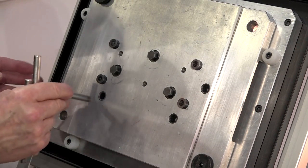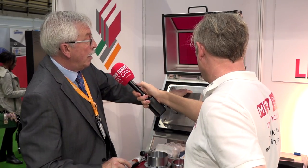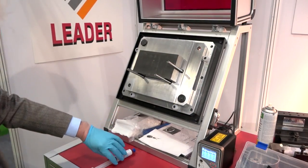These hex bolts here are raised slightly higher to get that 1mm of adhesive on the surface, and then the part goes into place. That gives you repeatability for big batch runs, and of course you're not limited by component size. One limitation we had with our ice chuck was how large a component it could hold — this gives us greater flexibility and also allows coolant to be used while machining.